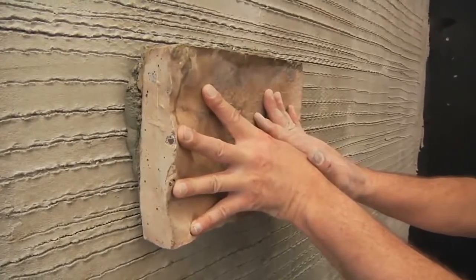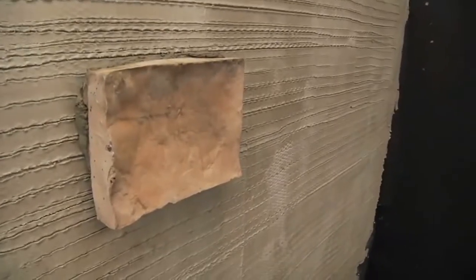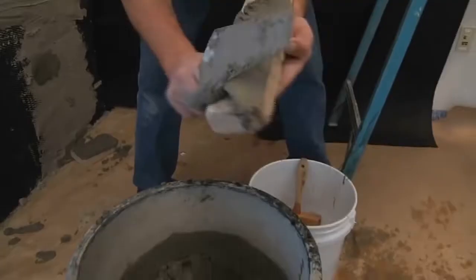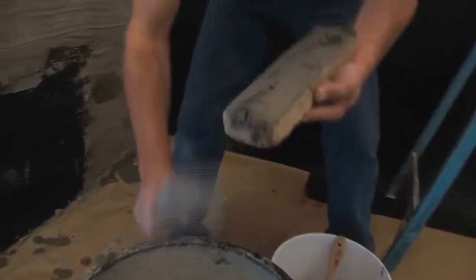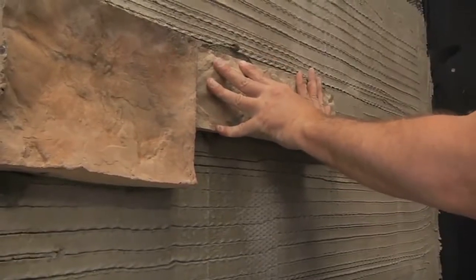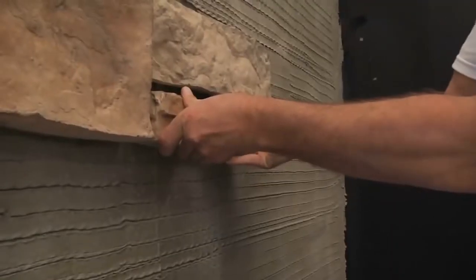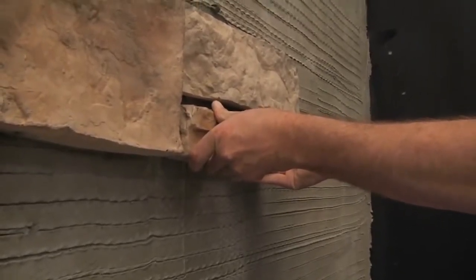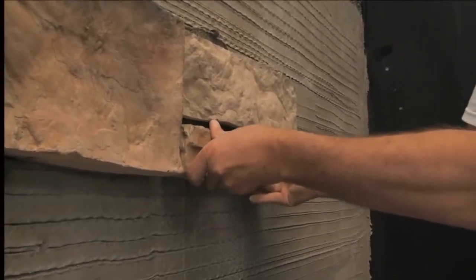Installing the veneer requires the installer to hold it in place. It is not possible to adjust the position of the veneers after installation, as doing so will most likely cause them to fall off the wall. Although widely used, this method is not designed for adhesion to vertical substrates. Further, the materials used do not protect against water intrusion. The metal lath often rusts and deteriorates, resulting in delamination. In summary, these traditional methods and materials are not engineered as part of a complete wall system and therefore do not offer the necessary performance or warranty from a reliable source willing to stand behind the installation.